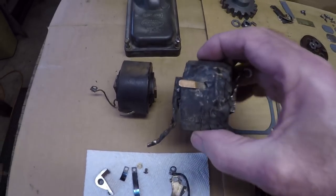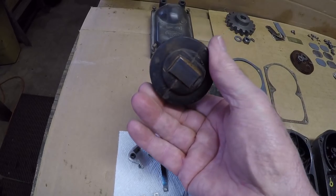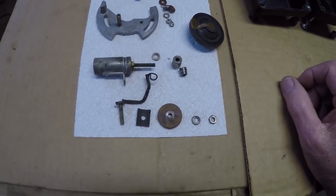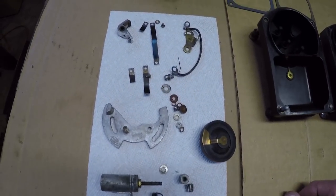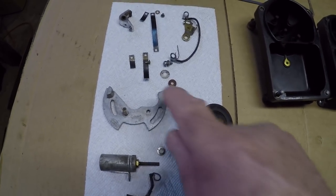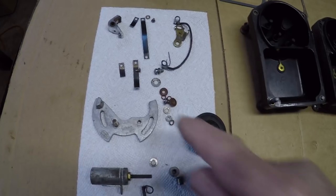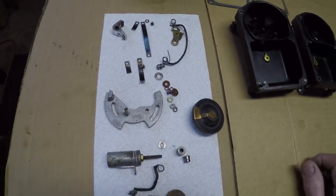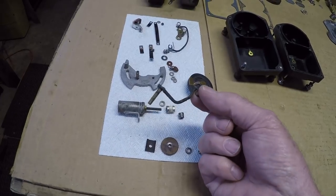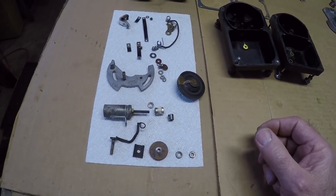Here are the coils. This is the original coil I took out — doesn't look real good, but it did spark good. I do have another coil I'm going to try. It's unknown condition, but we'll put it in there and give it a try. Last is the whole points and condenser system. There are almost as many parts and pieces in this as the rest of the mag together. The spring for the points comes in four different pieces — so if it looks like it's broken when you tear it apart, that's the way it's made. Contacts look real good on the points. Some of these wires are getting pretty old with insulation coming off, but I do have some better stuff in other mags, so that might be replaced also.